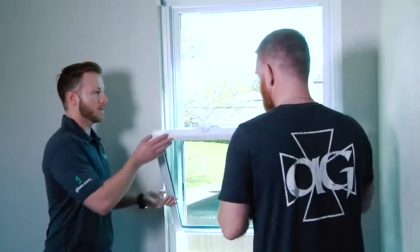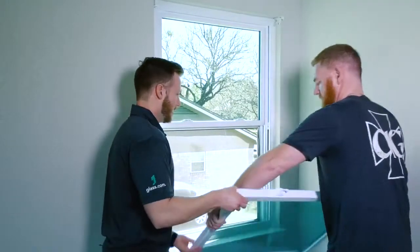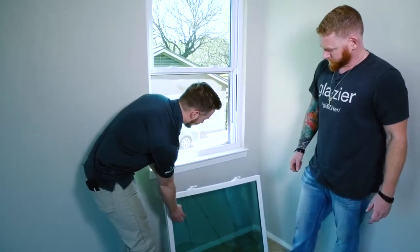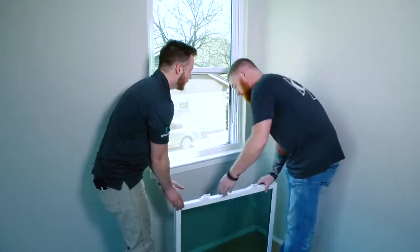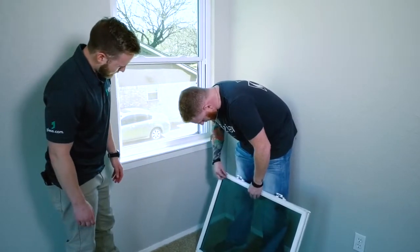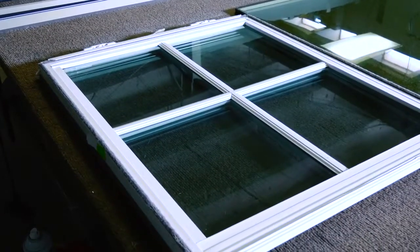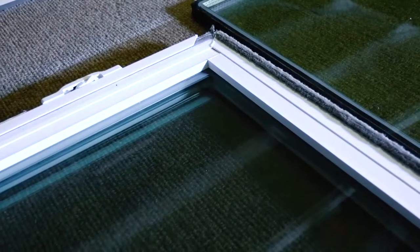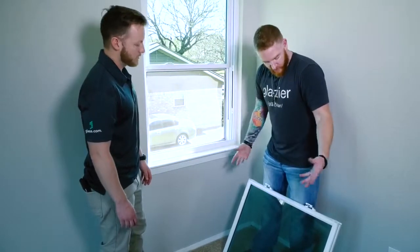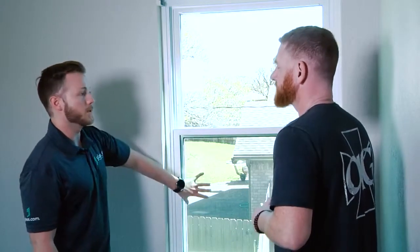You can actually remove this whole piece right here — just pop it right out. For replacing the glass, this vinyl stop right here comes off, then we cut the piece of glass out of the frame. New silicone work, new piece in, and these aesthetic stops cover the edge of the unit so it all goes right back together.